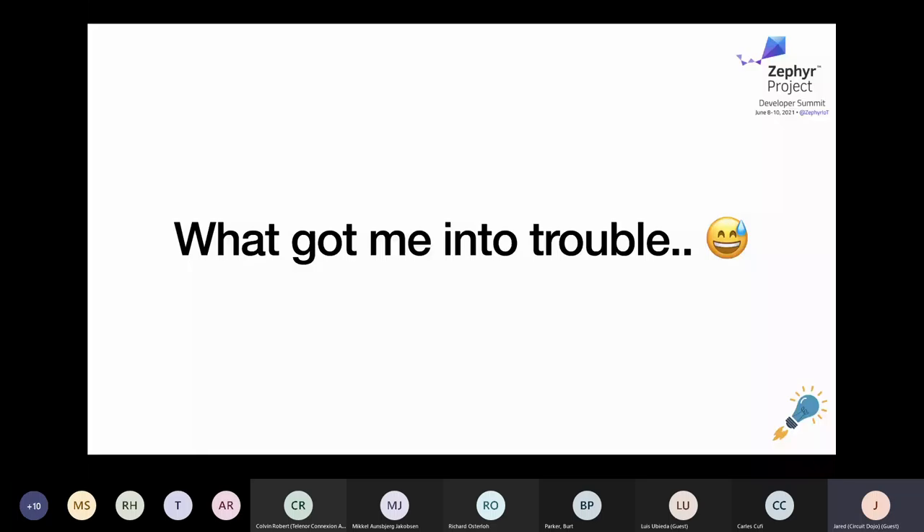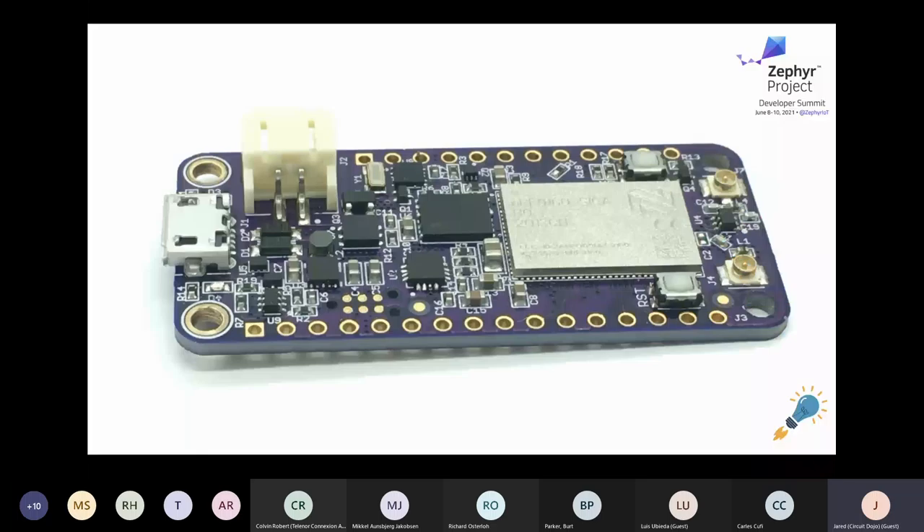Along with my consulting, I stumbled on a happy accident, which is the NRF 9160 Feather. I designed it from the ground up to use some of the great features in the NRF 9160 — low power, super low power, deep sleep, dual UFL connectors for both GPS and LTE antennas, onboard storage with NorFlash, a battery charger, a SIM card holder on the bottom side, and an accelerometer from ST.